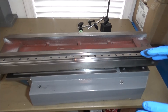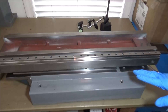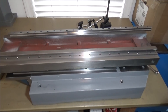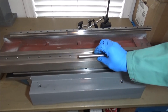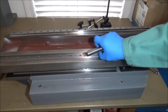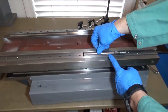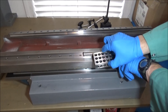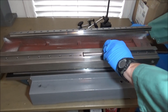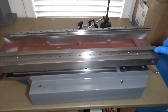Today we're going to start preparing to install the rails. In the last video we installed all of our datums and I showed you the rod technique to transfer the straight edge from the machined dovetail. We know this area here is machined — we can transfer that by using a rod, resting our one-two-three block up against it to line up our datums, since we're not real sure how straight the tip is.